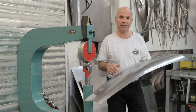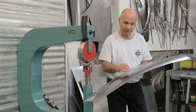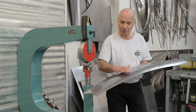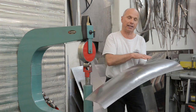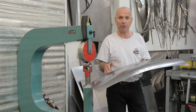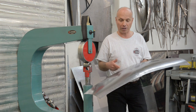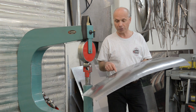In this case, what I'm going to show you in this video is that I'm going to just help it and shrink it on the edge a little bit and be consistent, and I can do that with a small shrinker. When I do that and make the edge shorter, this surface is going to be coming up and it's going to be all wavy on this side. But I will take care of that and you will see how that moves and we get it to this shape. This was actually a question from a student from Australia after he took the class on how to make a panel like this, so I made a video for him.